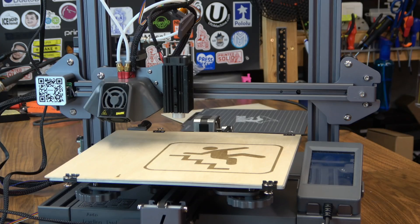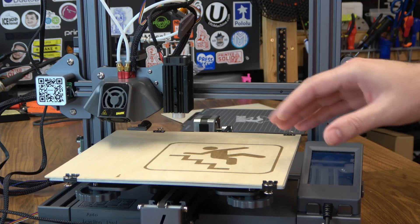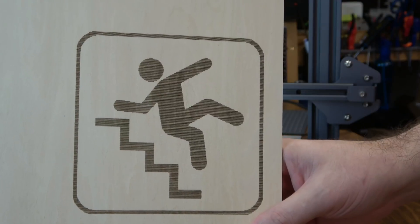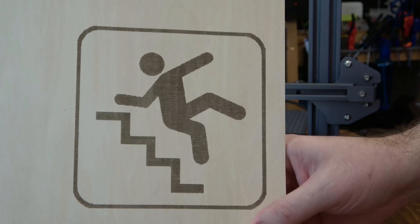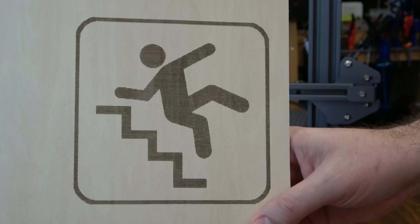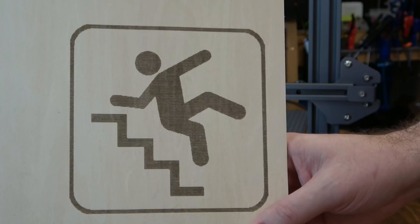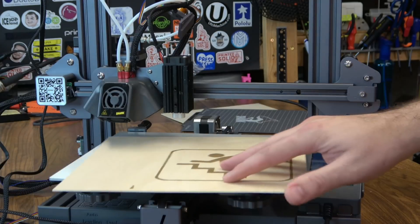The job is done — it took about 45 minutes to complete. I'm sure you could adjust the power and work speed to make it faster, but you might have to play with it. All in all it came out okay. I'm not really impressed with their software — there's not a lot of options to play with. But it is just raw G-code; they use M3 and M5 to turn the laser on and off, so you could probably use those commands in another more robust laser engraving software.